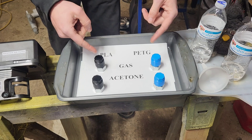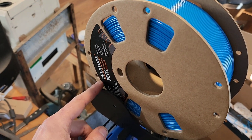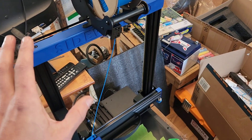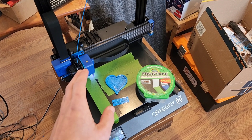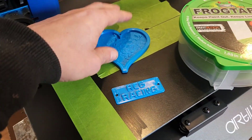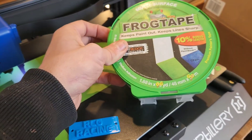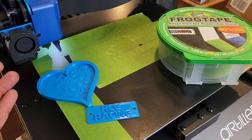We're going to let these sit about half filled with each of their items and come back and check it in one hour. I've found that filament brand choice is a big deal with a lot of people, so I'm including all of the links for everything I used for filament in this video. These Sidewinder X2s by Artillery are available on Amazon and Banggood.com — I will include links. I also wanted to point out that with this PETG, we ended up having to do the masking tape method. Everybody online says to use blue masking tape; I didn't have it on hand so I grabbed some frog tape, which I've used for many years, and the frog tape definitely worked.